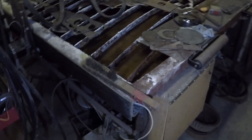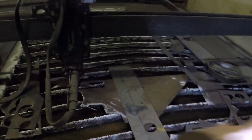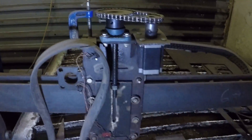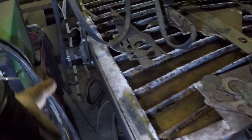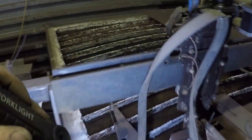This is my plasma table. It's pretty much just made out of random junk I had lying around. I had another plasma table before this that I made — it was just done with some threaded rod for my Y and X axes. But this one was a big step up. It didn't cost very much. The steel was just some stuff I had lying around. I did buy this rail on eBay. The first version of this table I actually did with chain and had my motors with some sprockets on it, but I found it would jar too much trying to cut. So I went to this rack style — it's much better.